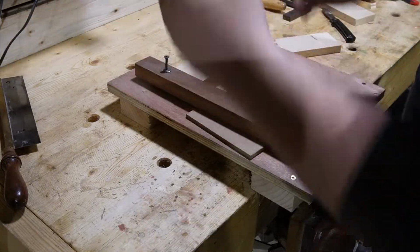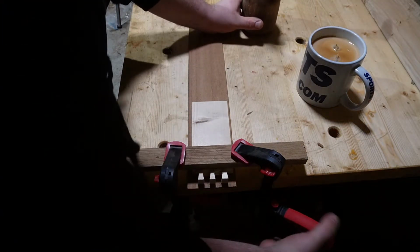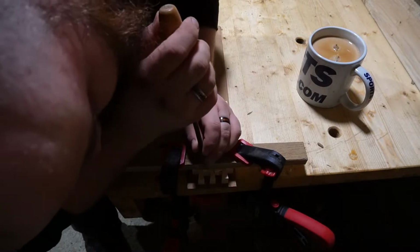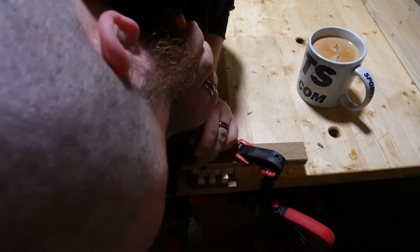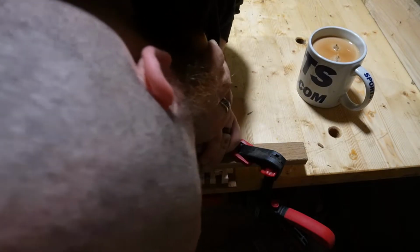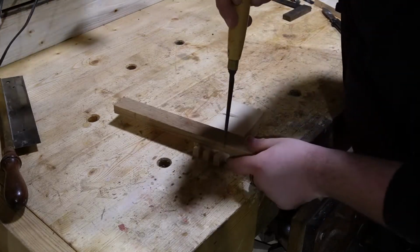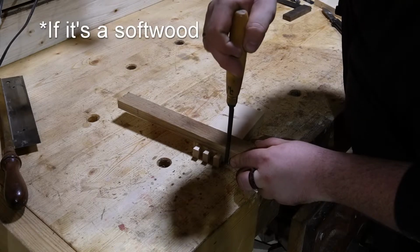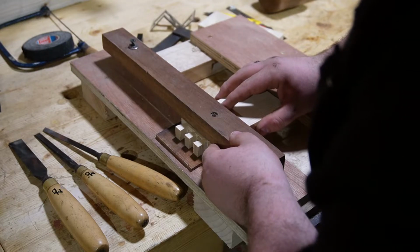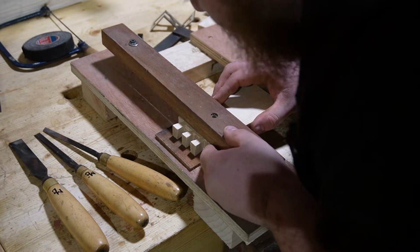Now you don't need to make a jig for this. You can do the exact same thing with any perfectly straight flat piece of timber, put it on your table and clamp it down. The only recommendation I would have here is to make sure this piece of oak is out of a hardwood, because the pressure of running your chisel up and down like this will wear into it, and eventually you'll end up with an uneven line. Now if you were interested to see me make one of these jigs, just leave a comment and I will.